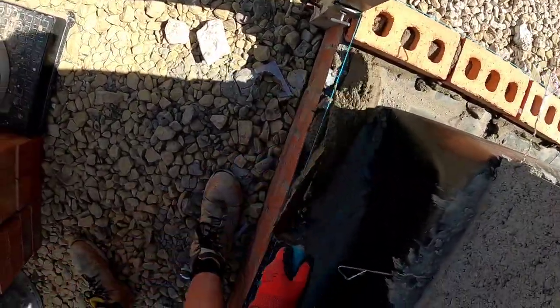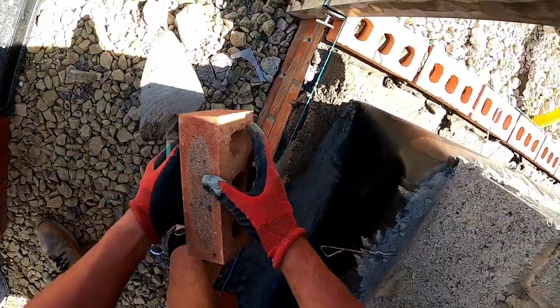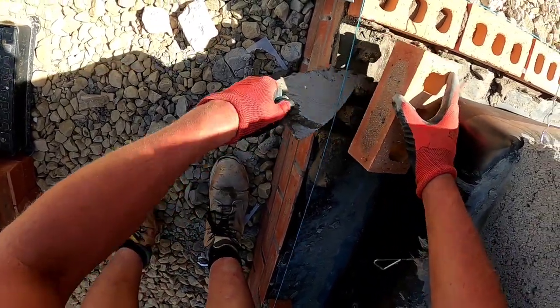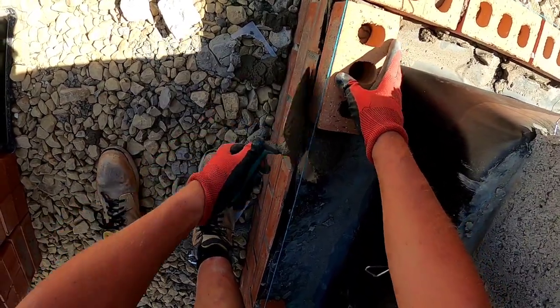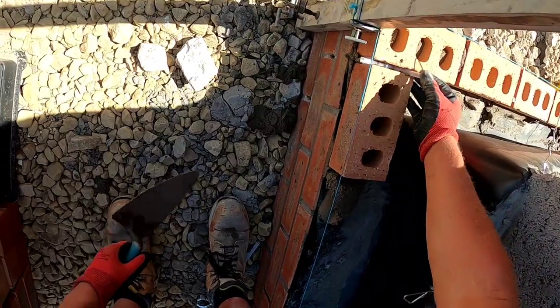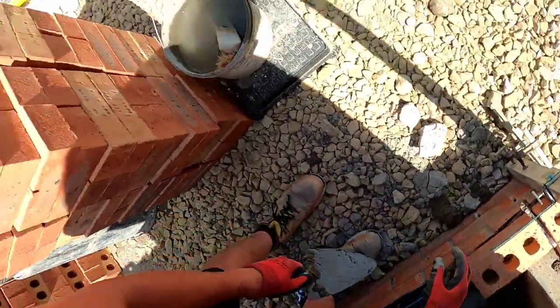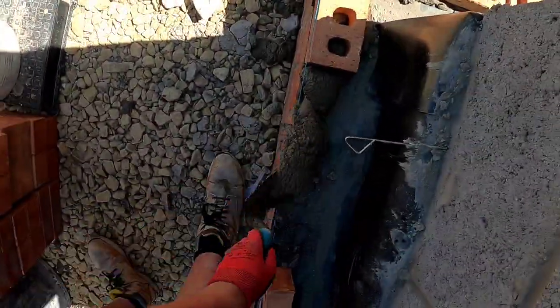Just can't take any chances — double check the damps. I put a four inch damp under this big radon barrier or continuous damp, just because if there's anywhere that the barrier or the continuous damp doesn't cover, there's another four inch under it. I just go a little bit overkill on some stuff. I still point the back of my block, even though it's all insulated, full fill.